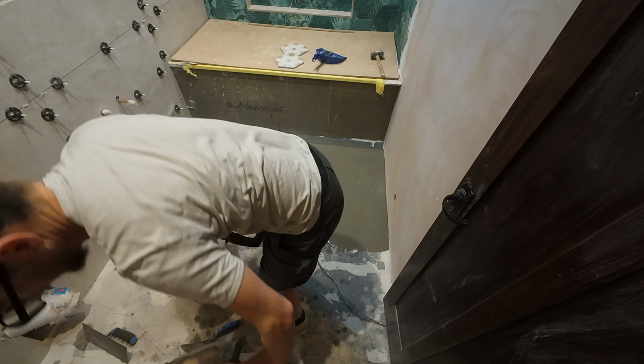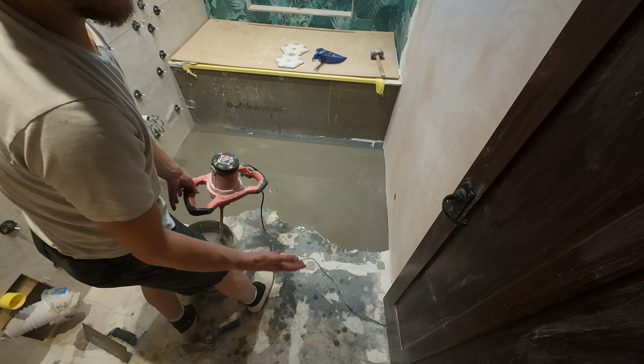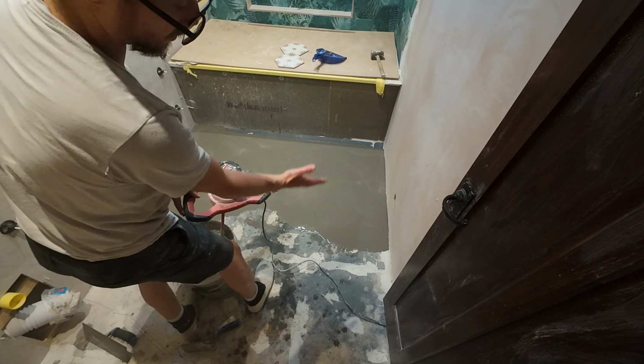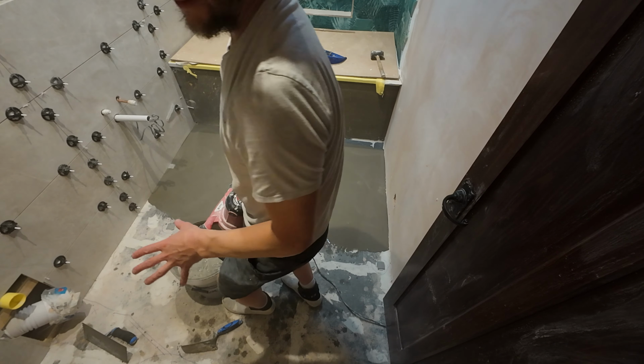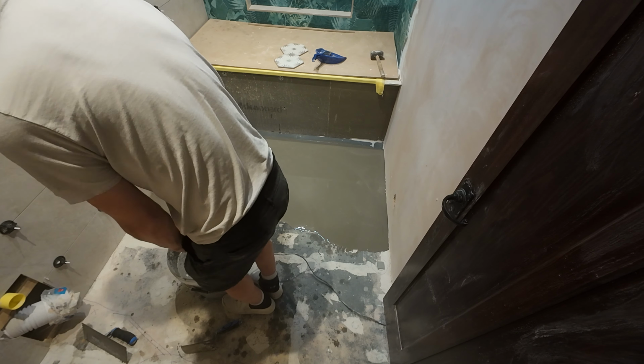Right, let's go all in and get the second bag knocked up. I just want to make sure I knock it up. If I, again, had a bigger room, I sometimes use a gorilla tub because you can get 2 bags in it, because you want to make sure you can still get your other bag of self-leveling to go into your last one before it starts turning.